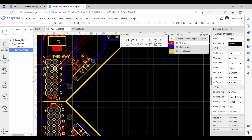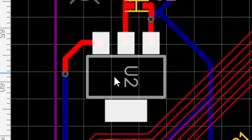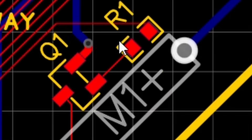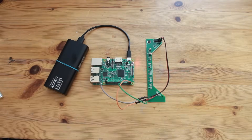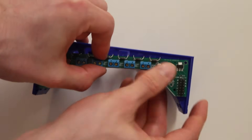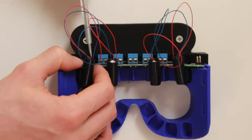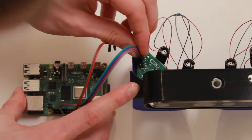I designed and printed a circuit board to control the motors. This is an LM1117 linear voltage regulator which drops the input voltage from 5 volts to 3.3, and each motor is controlled by a BJT transistor connected to a PWM output pin on this Raspberry Pi. Getting impatient and eager to try these out, I'm attaching the circuit board to the goggles, adding the sensor, connecting the motors, and fixing the processor.